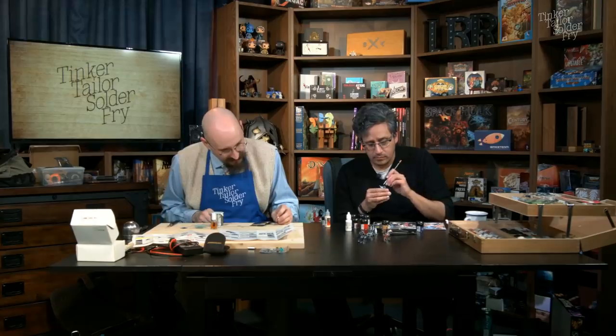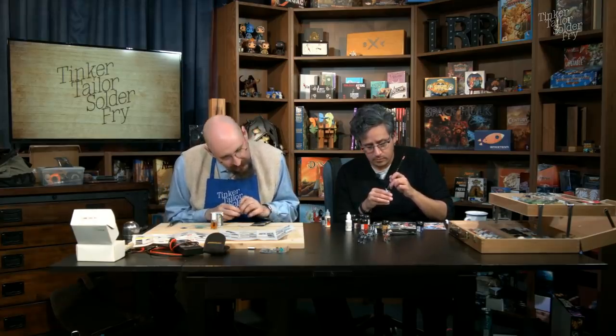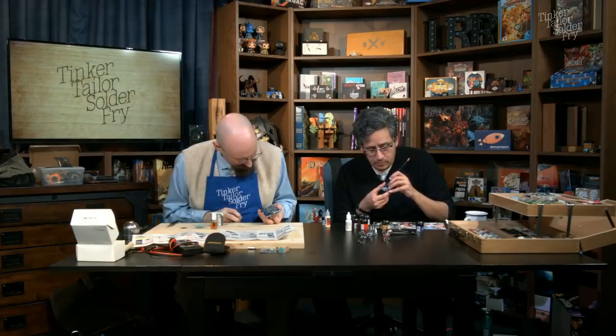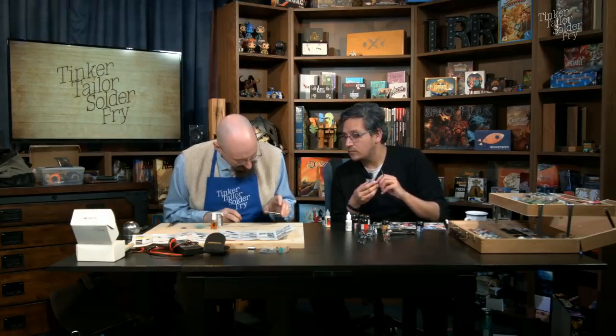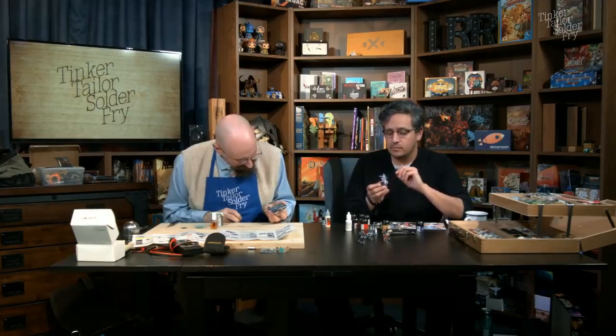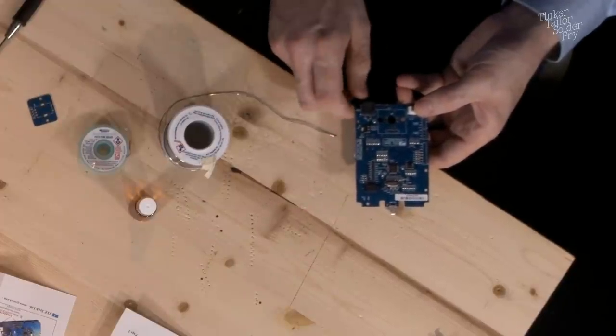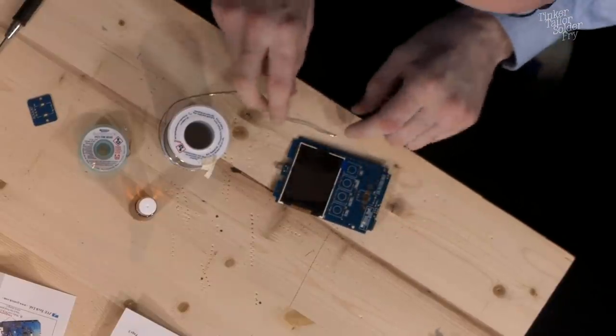Next up, J6, pitched right angle power connector, optional. You go on the back of here, I guess. Oh, wow, this is not exactly the most well-labeled of circuit boards, shall we say. That's ground. I'm pretty sure that it's just these two up here. Oh, no, I was completely wrong. It's at the bottom. Good thing I didn't try to solder up at the top, because I was about to solder the power to the section of the motherboard intended for the BNC connector. Whoops. I'm getting a very strong signal here. 9 volts, exactly.